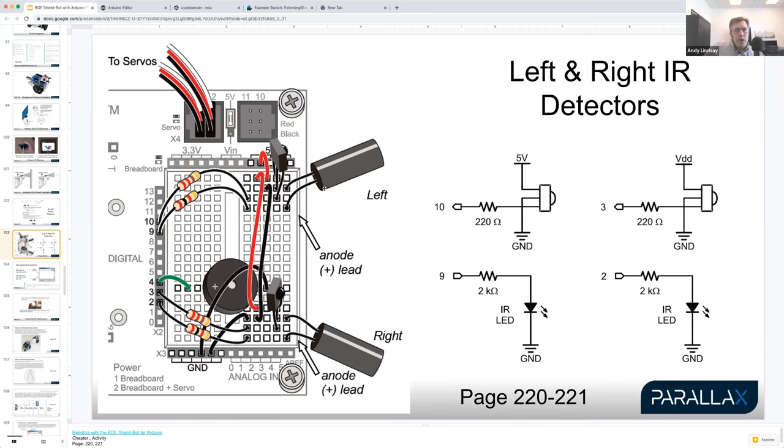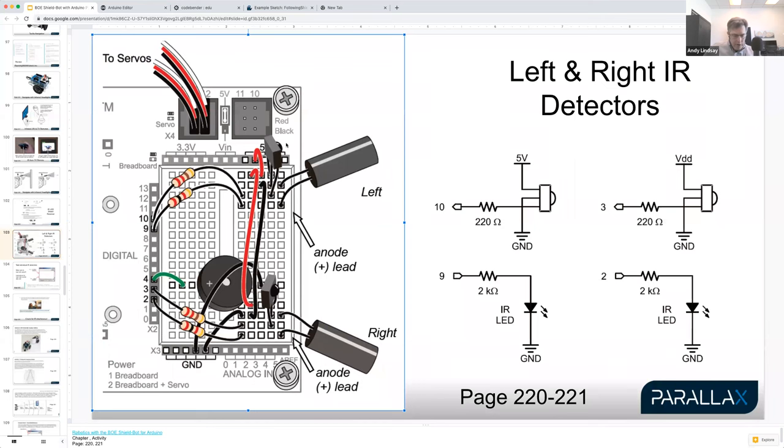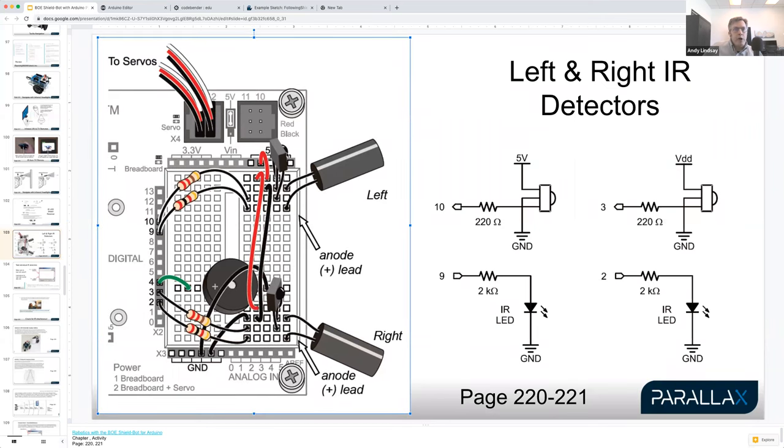For any of you who already have your circuit built up, it's very important to go through and check every single connection. For example, starting with 5 volts, the first jumper goes to the topmost row and shares the topmost pin of the infrared receiver. The little bump on the infrared receiver, which is where it lets infrared light in, should be facing forward, the same direction as your infrared LED.